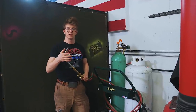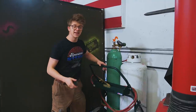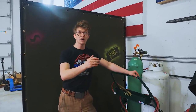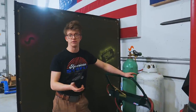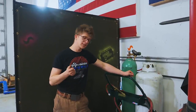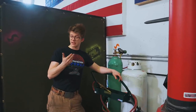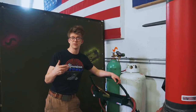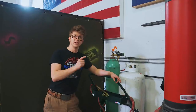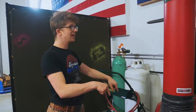This is the oxypropane set we have. In the UK I used oxypropane — it's what I've used since I first ever did any oxyfuel work, and I never anticipated needing to weld with an oxyfuel set. So I got an oxypropane cutting and heating set because the propane is cheaper. Provided you dial it all in right, I don't think there's meant to be any difference in the performance of heating and cutting with propane as opposed to acetylene. I know a lot of you guys have asked about that.